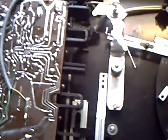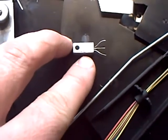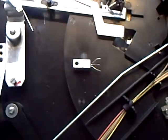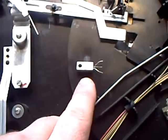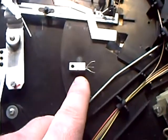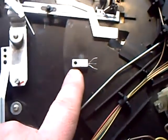I was getting no sound at all through the right-hand channel and the culprit was this little chap down here — AC188-01, sometimes called AC188-K as well. And that had gone fut. It was doing a very strange thing. Normally the tin whiskers on these have affected the junction itself inside the germanium — the build-up of metallic whiskers by electrolysis occurs and this causes the transistor to go short circuit. But this one had actually failed in such a way that I was getting a reading from the legs to the casing, which I shouldn't — it should be infinite. So obvious what it was.